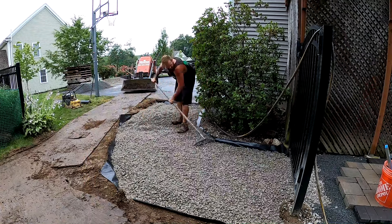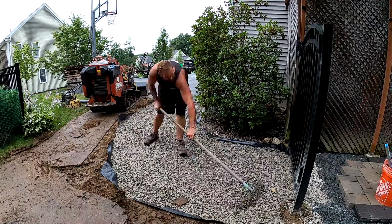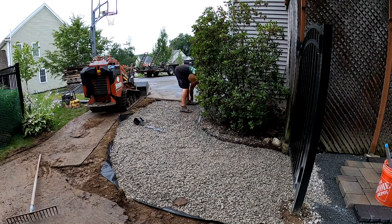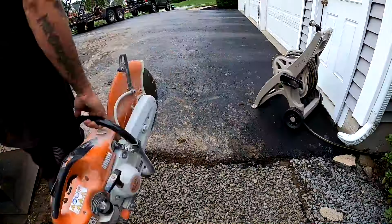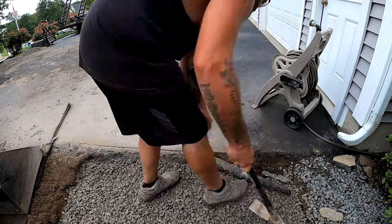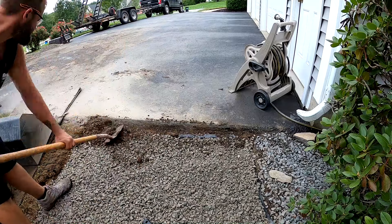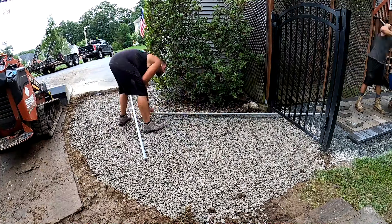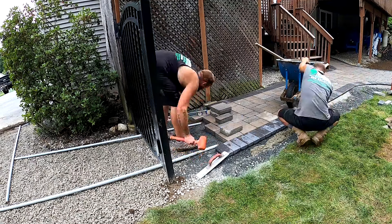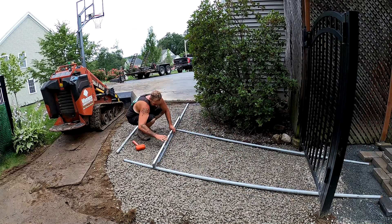This system is number one for drainage and stability for pavers. In a regular install using dense grade or classified material, water gets held under the pavers, but this base does not hold water — the pavers never sit in a puddle. I've used this system for three years and will continue until something better comes along. Now I'm setting up my screed pipes, trying to match my existing walkway and driveway and mesh the four pipes in the middle.